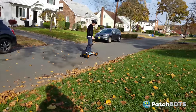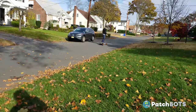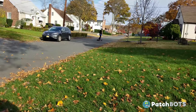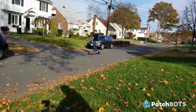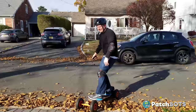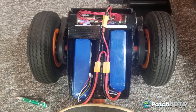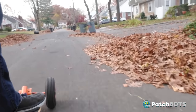Unfortunately what you're looking at here is top speed. The remote has four speed settings and this is the highest with the pedal to the metal. I had assumed the speed calculators compensated for an average-sized person, but wow — this is way off. What a bummer. But I refuse to let this video end on another low note. I took the board back in, desoldered my previous ESC changes, velcroed the 10-cell series back into the now oversized compartments, made some precise modifications to the outer box, and got back on the board.